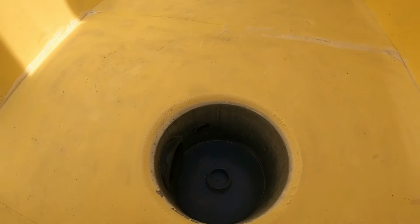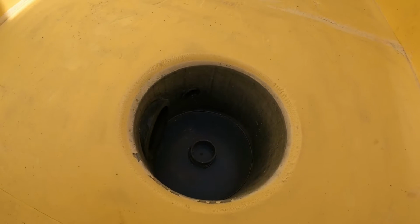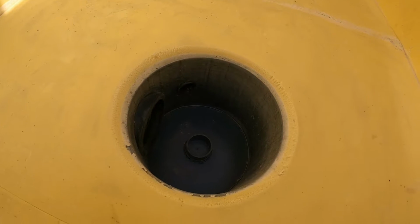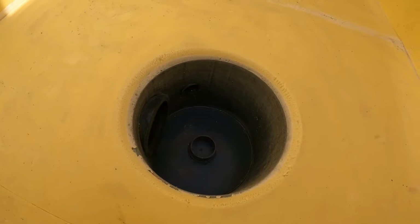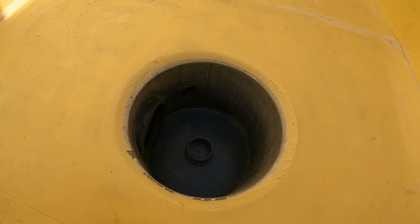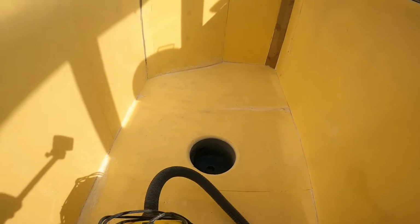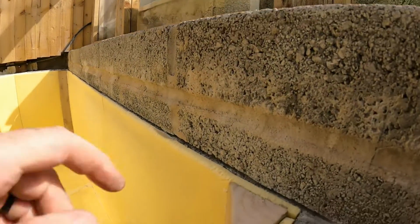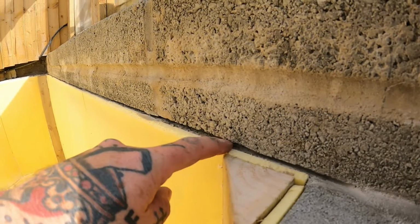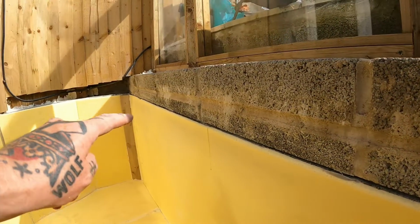more than just roughing it up with a 40 grit sandpaper pad, I've put some score marks in as well with an old rasp, just to get some deeper gouges in there, so to make the resin stick to it as best I can. Kind of filled in all the little holes, you know. Like I said, it's as good as damn it. What I've done here, guys, like I've said, is if you can look at this, I've rounded this off as best I can, and I've ground an edge all the way through there.